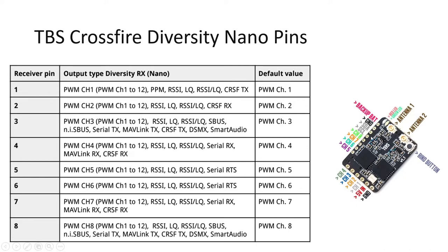In my build, instead of a magnetometer only, I will be installing a complete IMU so as to have your magnetometer, barometer and accelerometer all together in one module, which I'm going to connect using this SCL and SDA, so that you can do as well. So here you can see, in addition to that, you can also connect a backup battery like I explained before for the beacon mode or to find a lost drone.